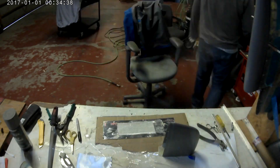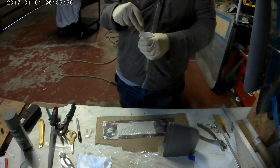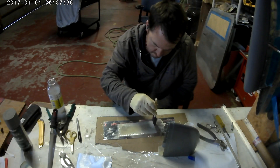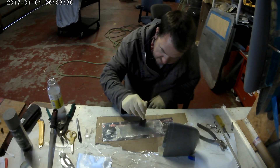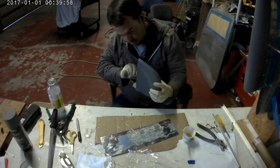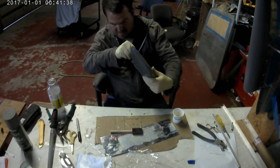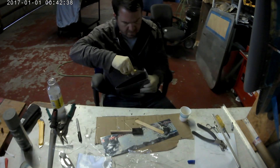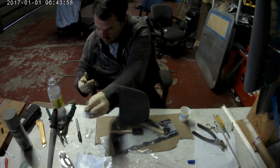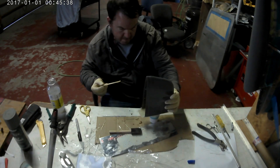It's beautiful, but you can see where going from the vertical stabilizer to the rudder it's not a perfectly straight line. Those black lines you saw me drawing on the top of that fairing — that's where I plan on putting some filler. With that I'll be able to make the two match. It's purely an aesthetic thing; it's going to fly perfectly fine. It's just a small detail, and since I seem to have some natural talent for this, I figured I'd just go for broke.